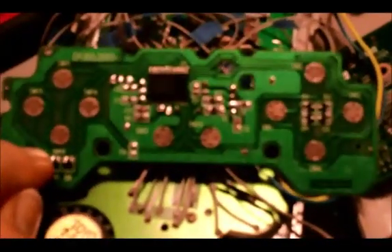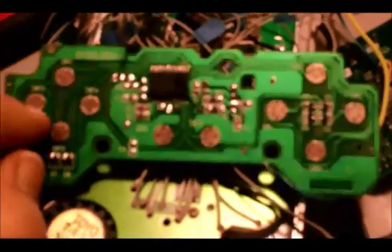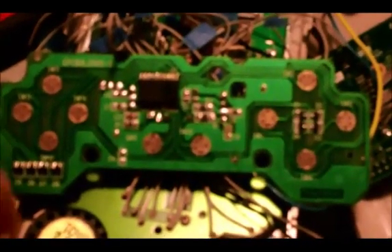The reason is this here — I can actually replicate all of these support components either dead bug or on a much smaller PCB. These are just diodes in order to expand the amount of controls this has. This is a 10-button controller, all digital — no analog. I don't want analog in this thing. If I want an analog controller, I'll plug one in.